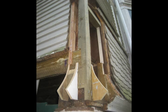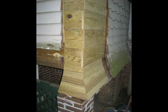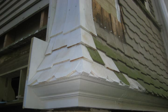It took me about 5 hours altogether to profile the scraper and then to scrape the shape of the about 3.5 feet of molding into the wood. If you're making a smaller molding, you will find it goes much more quickly than that. The appeal for me was that I was able to make this for free, essentially with tools I already had lying around, and end up with a quality result that would have cost many hundreds of dollars to have made at a millwork shop.